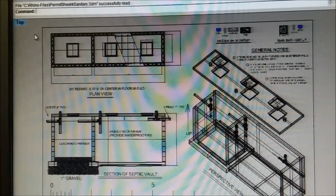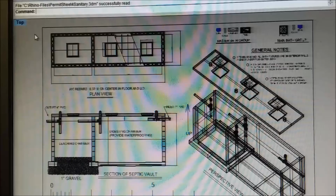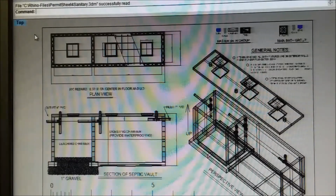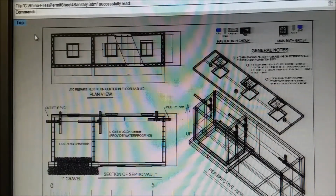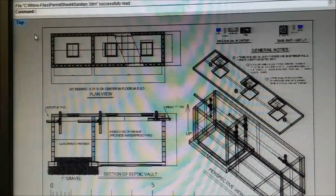Now they have requirements from the fire department. You can't have an exterior door or several other things that take the place of an exterior door that requires any special knowledge or any tool to open. In other words, an average person walks off the street, they should be able to get out that door within a few seconds, even with a smoke-filled house.